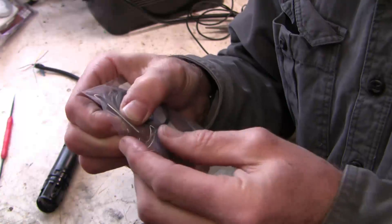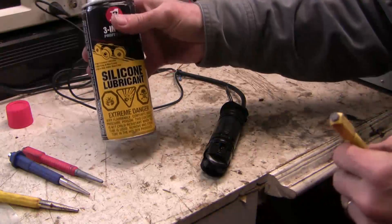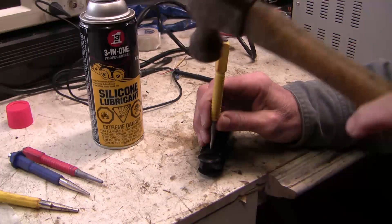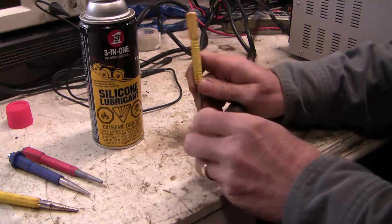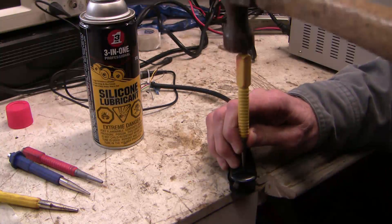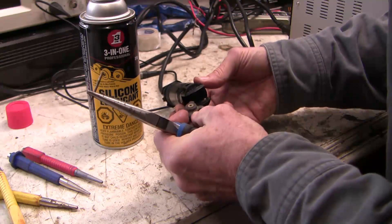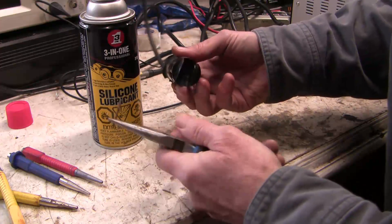There's a little stainless steel pin here — I need to tap the old one out and put in the new one. I sprayed this with silicone spray — make sure you don't use anything that could damage plastic. I've got a little drift punch here and I'm just going to tap it to see if I can get that pin out. Seems to be moving... oh yeah, it's moving. I'm going to take the opportunity to clean this out a little better since I wasn't able to clean it well before.